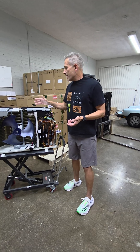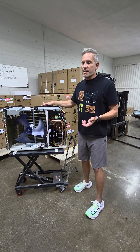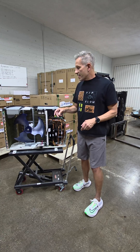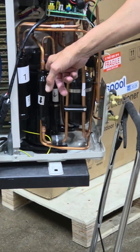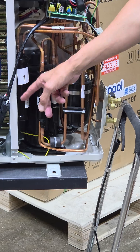So what's the trick? It gets this outdoor coil here to be way below minus 22 degrees Fahrenheit, and that way it can soak up the heat that's outside. Meanwhile, part of the refrigerant goes into the compressor to pre-pressurize it and pre-warm it. And all that happens in this flash canister, which is a heat exchanger.